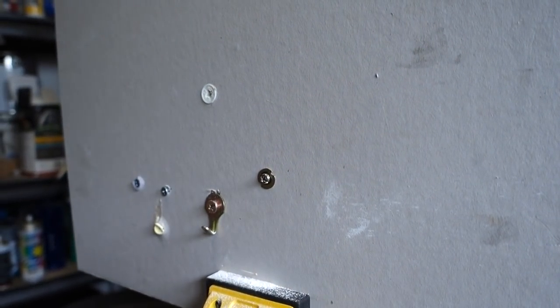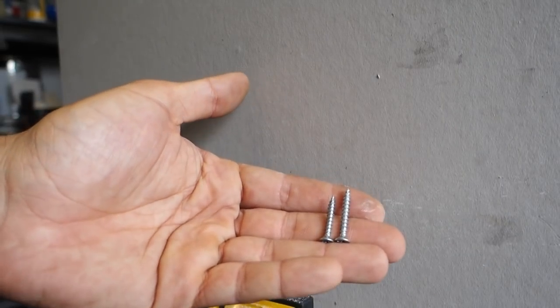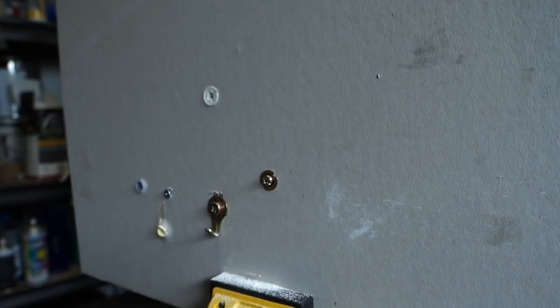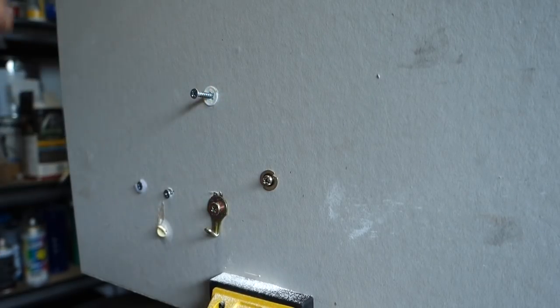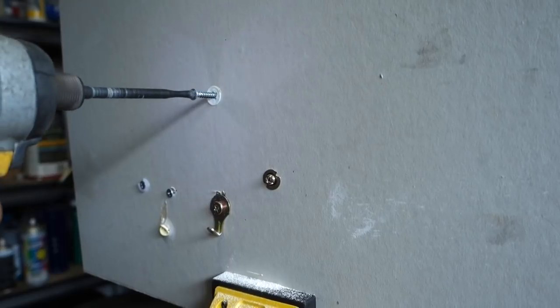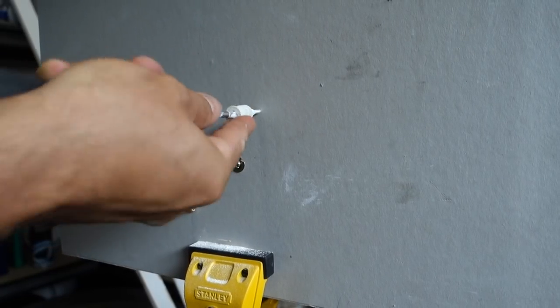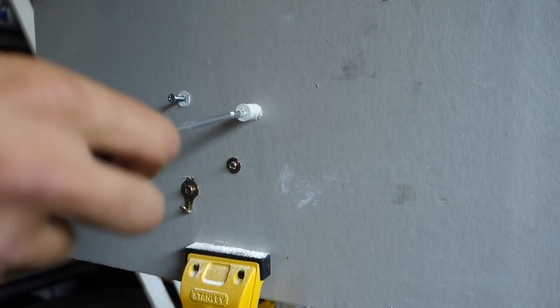What I like about these ones is they usually come with screws with the actual wall plug itself. However, you can put in any kind of screws that you like so long as it fits. I've got here some 25mm 6 gauge screws, a 30mm 8 gauge screw — 8 gauge is thicker — and also a 40mm, and they all fit in there perfectly. The way to test if it fits is just simply run it through by hand. You can bite that one straight through and now that's ready — we can either drill it in or hang something on there. Even with a screwdriver you can do the same thing, just apply a bit of pressure so you can start that hole, and it self-drills because it's got a really sharp point.